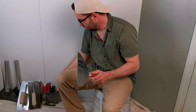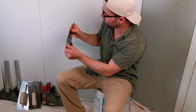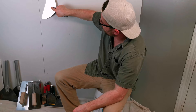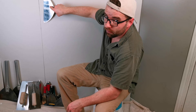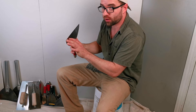What I mean by that is over a long period of time when you're pressing a drywall knife against drywall and feathering the edges, I find that my stainless steel knives begin to warp a little too much. Drywall knives naturally come out of the factory a little bit convex, so that lets you feather edges. You put the convex side against the drywall and the edges naturally lift off the drywall a little bit. That's what you want — just a slight amount of convex in a knife. However, stainless steel not being able to retain its shape as well, I find it starts warping and takes on a very exaggerated convex shape over time.